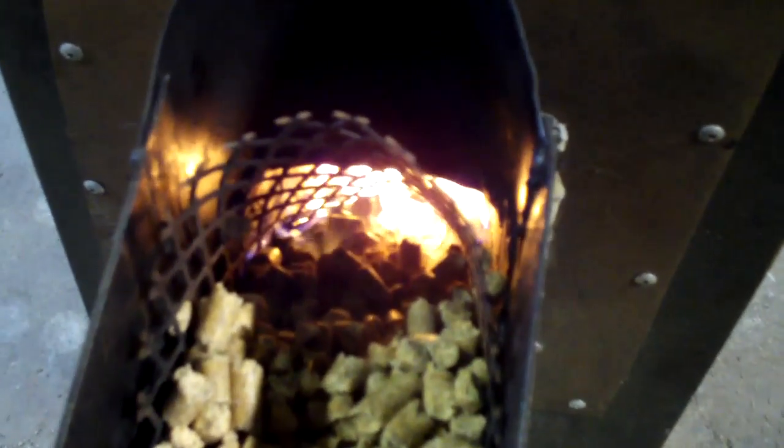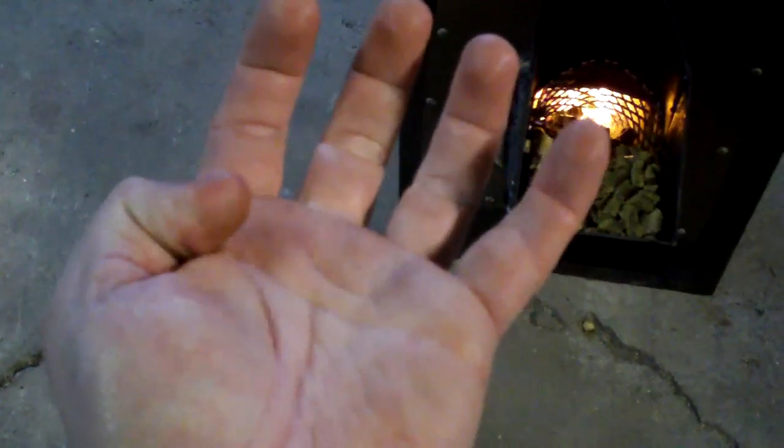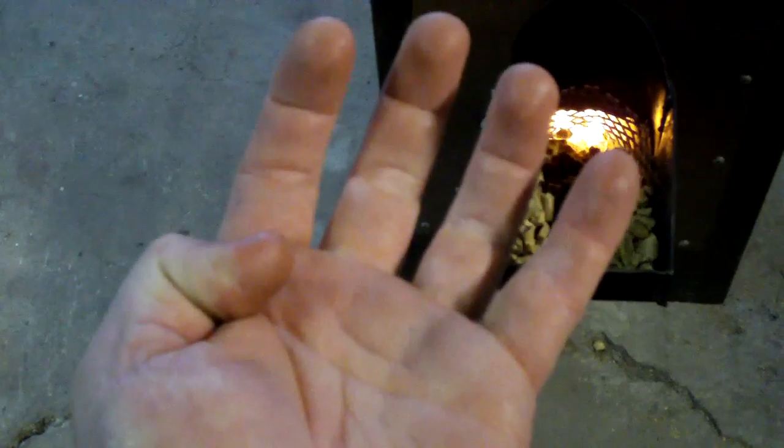I took and actually cut the grate, and it was hooked to a pipe at one point, and those little lips come in handy because they just kind of hang on to them. I shouldn't say lips. They're just kind of like if you bent your fingers, sort of like a hoe, and those pellets will go down and they'll sit on that grate and burn until they just fall through. Up here, the only reason they're burning is for the self-feeding part.